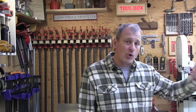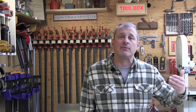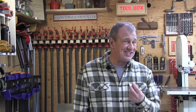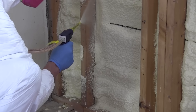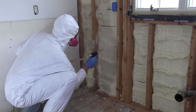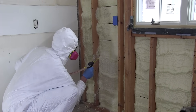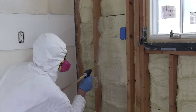We use 2 inches; you might be able to get away with 1 inch if you're in an easier climate, but we do recommend 2 inches as colder climates need more. The goal is to seal air leaks and to prevent warm, moist interior air from entering and meeting cooler exterior framing surfaces, which produce condensation. By keeping floor joists, rafter bays, and wall studs above the dew point, condensation cannot form, which will prevent mold growth and rot.